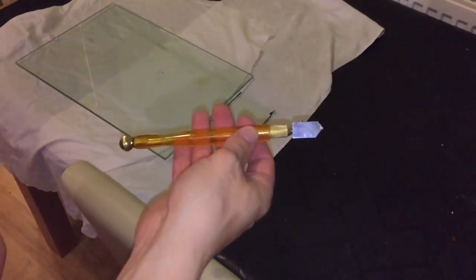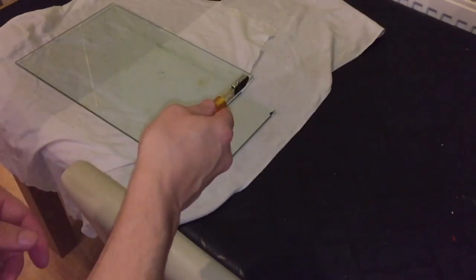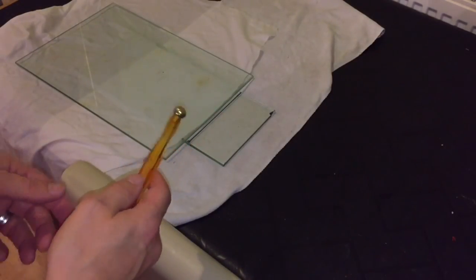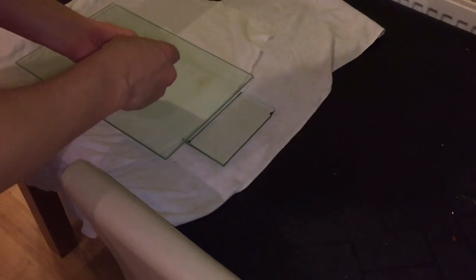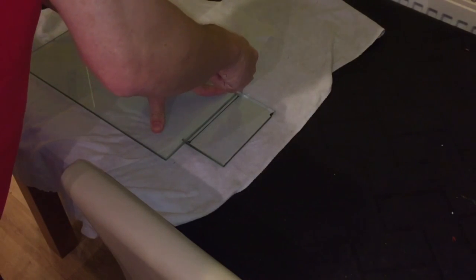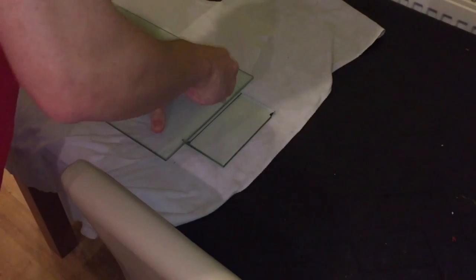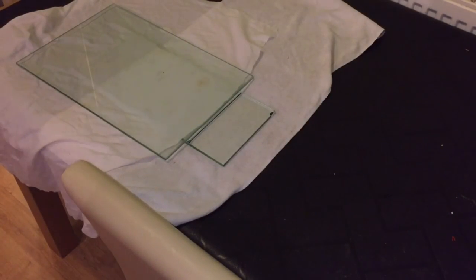Next I'm doing the return section. Like in the first episode you saw me taking out the baffle, so I'm going to cut the baffle and get it into place. Just showing this rough bit of glass and how I've prepped it — you did see me breaking it but I didn't show the marking. You just get your glass cutter, go straight down the line and score it once. Don't go over the line multiple times — just score it once and that's it.